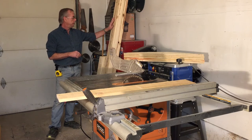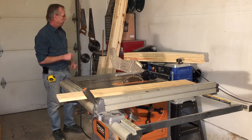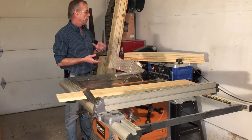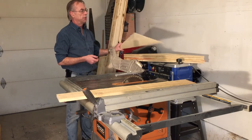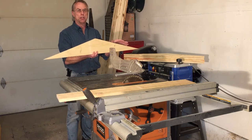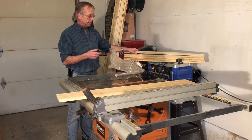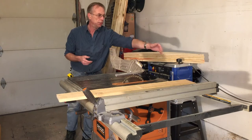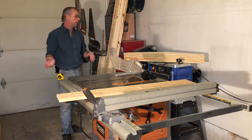We've already cut these to six and a half feet long and these pieces are 40 inches wide. There's a wooden barrier around the gardens to contain the soil and they're about six inches deep, which is the width of these boards. So I'm doing another six inches and tapering it from the edge to the center. I'll do two lids on top so you can open half from either side, so we can access it from both sides in the garden instead of trying to reach 40 inches in.